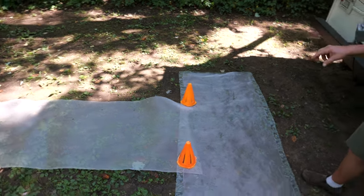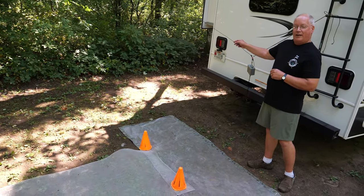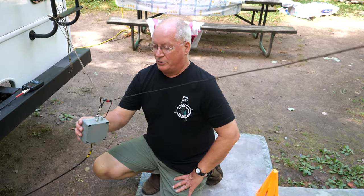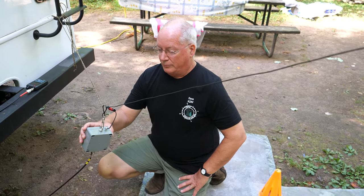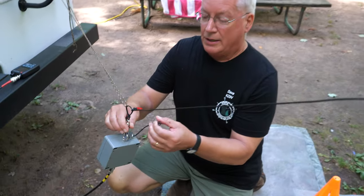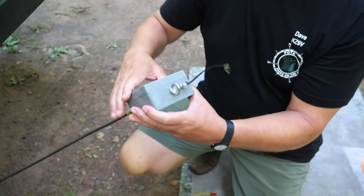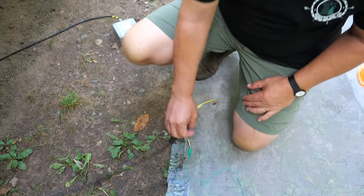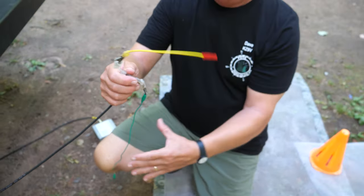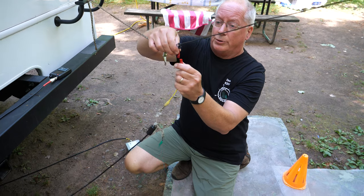I'm going to show you how we can use this with my 67 foot wire to come up with a very effective 80 meter quarter wave wire for after dark. So we're going to take the transformer off and convert this into a quarter wave 80 meter wire. I've got my Anderson power pole connector here, so now the transformer is disconnected. And we're just going to take this coax that I have with alligator clips on it — this will connect to the wire, and this will connect to the aluminum screen down on the ground. And with any luck at all, we'll be resonant on 80 meters.